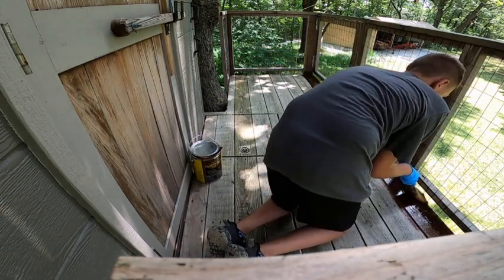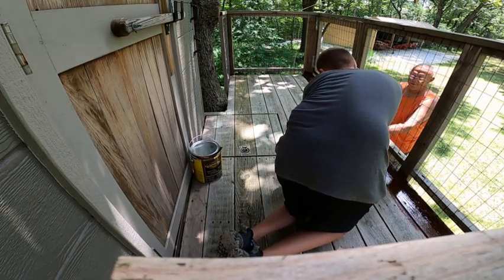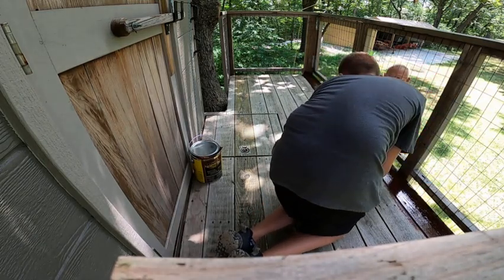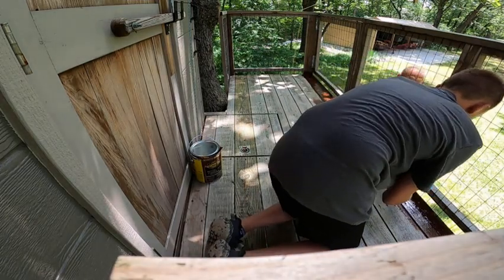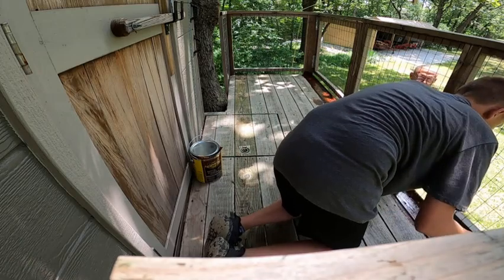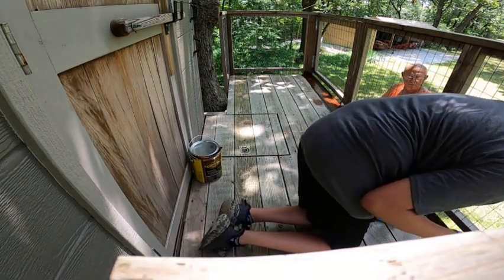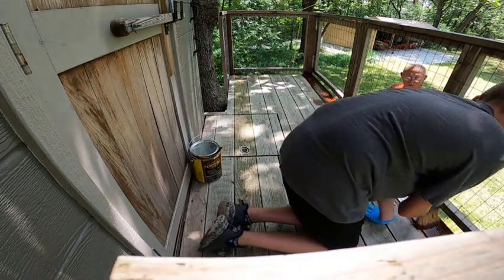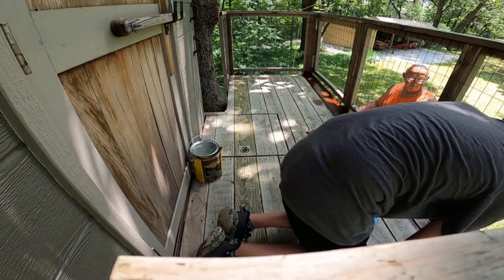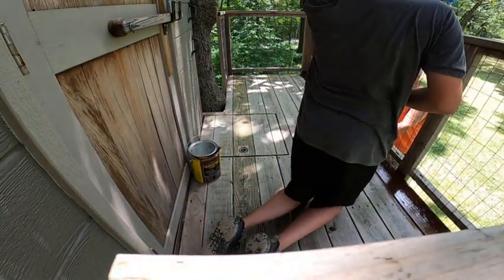Okay? And then wipe the grain. Yes. Just hold it, you got way too much on it. Alright. It's all dripping on the outside here. When you're tipping, you're making nice long strokes, no little pokes. Okay? All good? Yeah, looks okay for me.